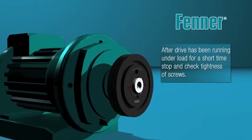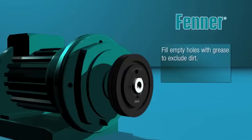It is desirable to check and, if necessary, restore full screw torque after the assembly has worked under load for a short period. This does provide reassurance that a sound assembly has been achieved. It remains only to ensure that the extraction holes and threads remain clean and free of corrosion by applying a small amount of grease to these holes, which of course do not contain screws.